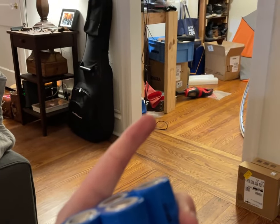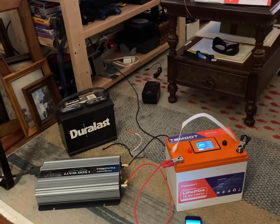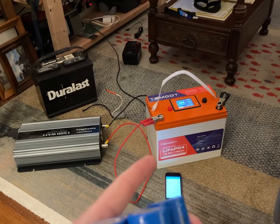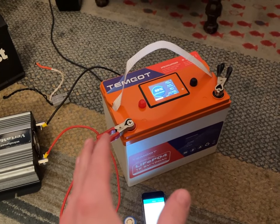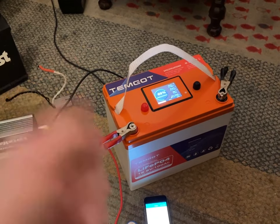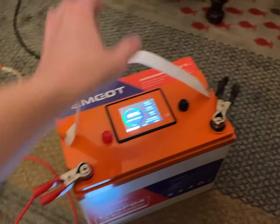And so I never could justify it, because I have little stacks of these Nissan Leaf cells, which are lithium ion batteries, such as that Milwaukee battery over there. They last at best maybe 1500 cycles, whereas lithium iron phosphate instead of lithium ion can last thousands of cycles. Their one issue is that if you use them when they're freezing, they can irreparably damage themselves. Well, these ones have a heater in them. They self-heat. So whenever I do barrel boats, this is going to be perfect.